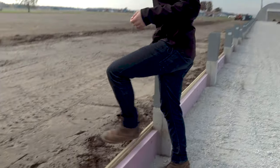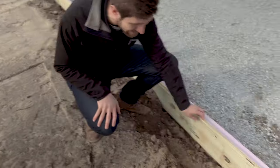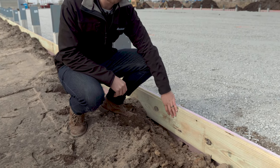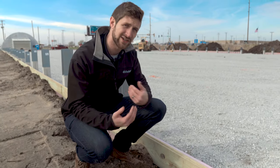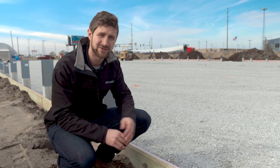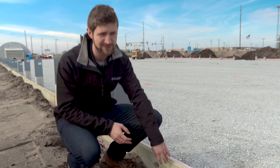Moving over to the other side, you can see this laminated column — this is a 2x8 laminated column. That's your baseboard, and this is what you attach your concrete to, along with your foam board as we saw on the other side. Some companies might do a 2x6, 2x8, or even a 2x10 if it's called for. A 2x8 is really a great size — it allows foam boards to be attached and gives your concrete the right guide and size to pour to. A 2x6 can make that a little tougher since it's smaller.